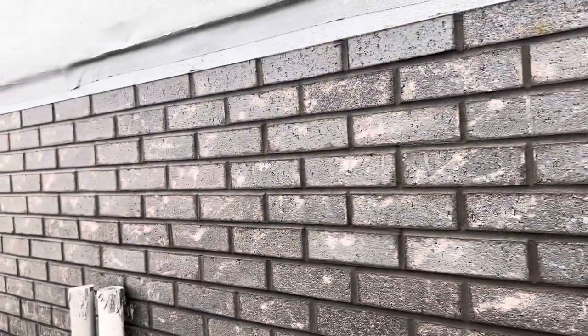You can see the size of the joints for the mortar — sometimes each mason does them wide, sometimes narrow. Each mason man does it differently, but we need to make sure to follow the string line so all the mortar is the same width.